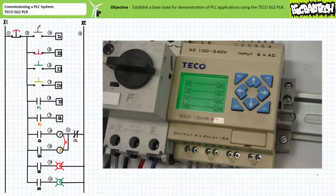A recommended test program is as follows. Rung 1 contains a MAKE instruction examining input I1, the normally open maintained contact selector switch, selectively energizing or de-energizing output Q1, the F contactor coil. Rung 2 contains a MAKE instruction examining input I2, the normally closed momentary contact red push button, selectively energizing or de-energizing output Q3, the red pilot lamp.